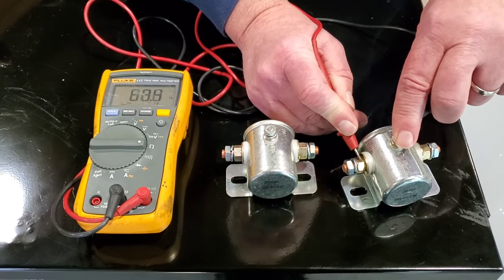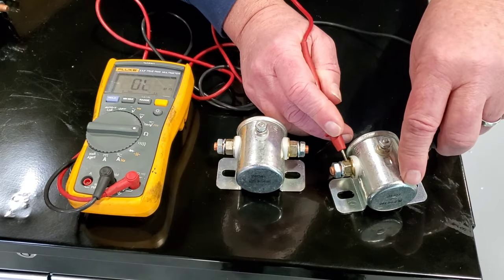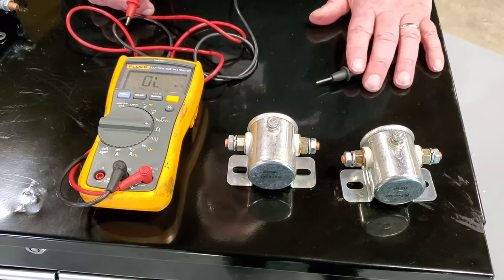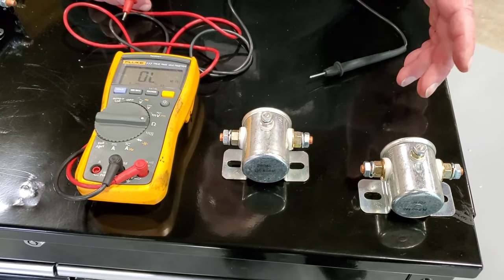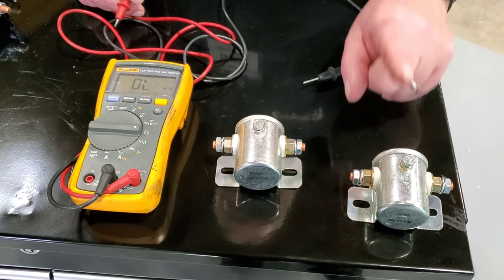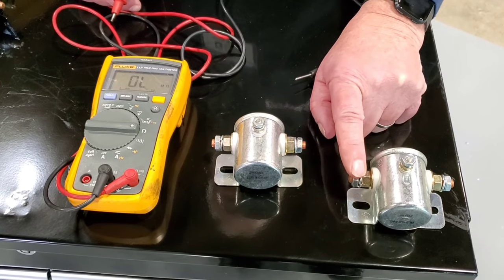This is a 24 volt continuous duty relay internally to the B plus, and then looking for ground to operate. This may be used as a safety, picks up its ground from an oil switch. There's any number of configurations, but this relay was meant to operate at 24 volts continuously. And a key thing here, this relay will only function if the B plus, the battery voltage that's continuous, not the switch leg, is on the correct side of the solenoid.